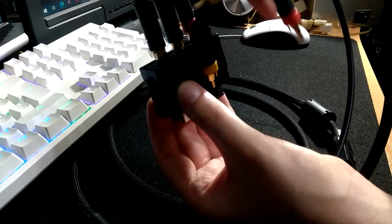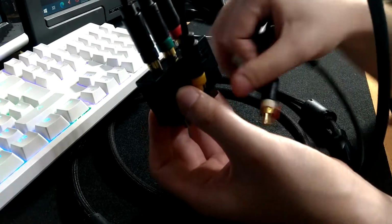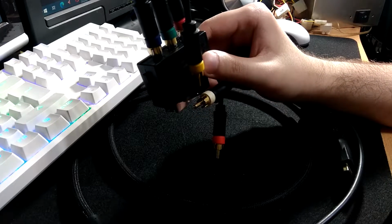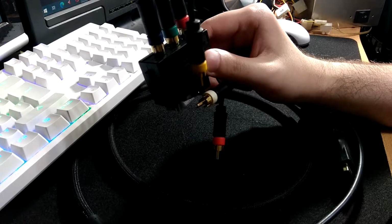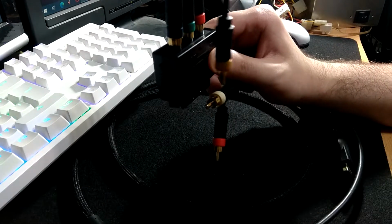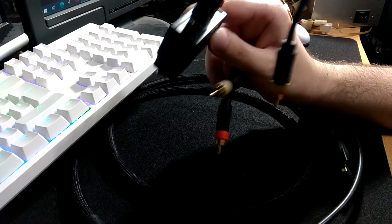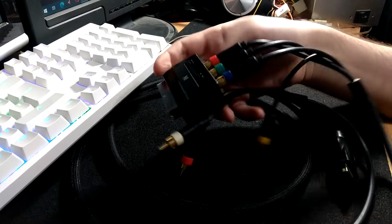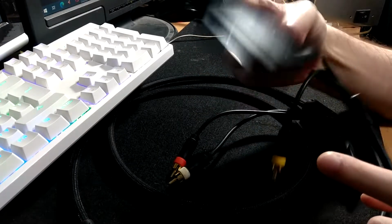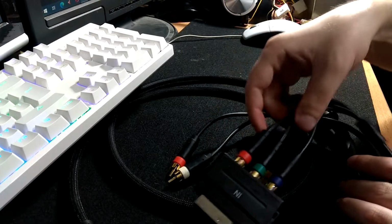Because my SCART switch has a separate RCA input on it that's basically shared between all the inputs, so you don't have to switch it or anything. It will automatically send the sync signal to this input. You could also just use 2 of these, one modified for RGB, and then the other one is just a straight composite video and audio for sync.